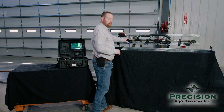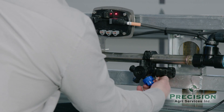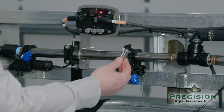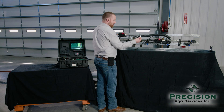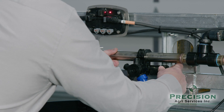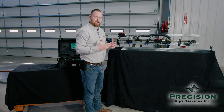On these nozzle bodies, they're designed by Precision Planting directly — their proprietary nozzle. I'm going to show you how easy it is to work on a nozzle and take one apart. The life expectancy of a nozzle is about 600 hours of run time. I'll pull the wire, pull the solenoid off, and pull the plunger. This is the plunger that sits inside of that PWM valve assembly — this is what has the 600-hour life to it. When that 600 hours is up and you go to replace it, all you do is take this plunger out and throw it away. It's a very inexpensive piece to replace. You plug it back in, put the solenoid back on, put the clip in place, plug it back in, and you're off and running.